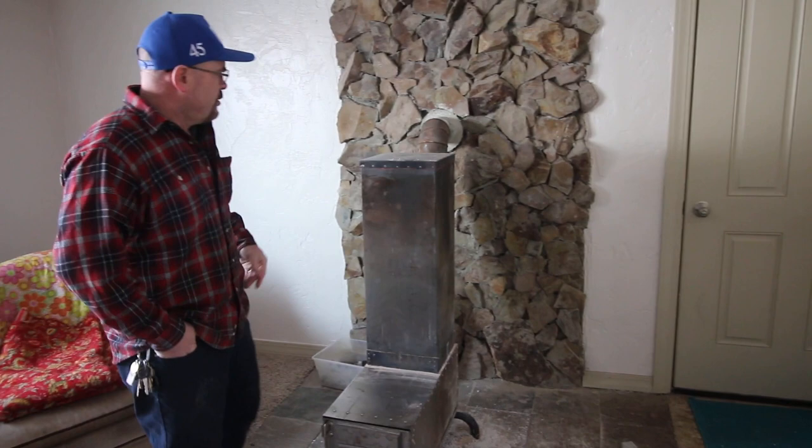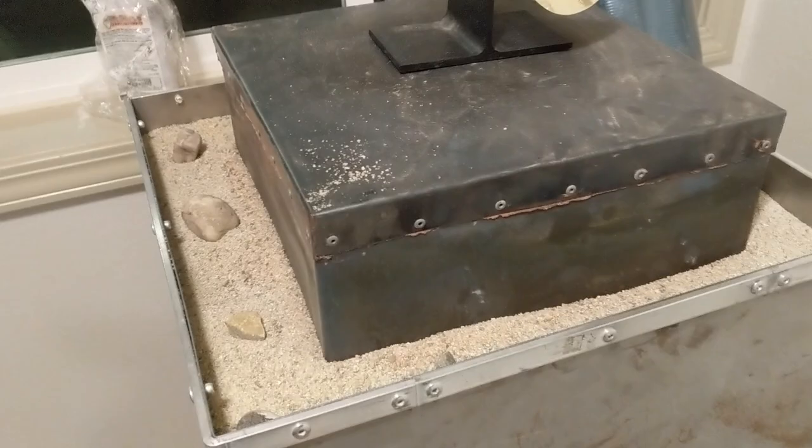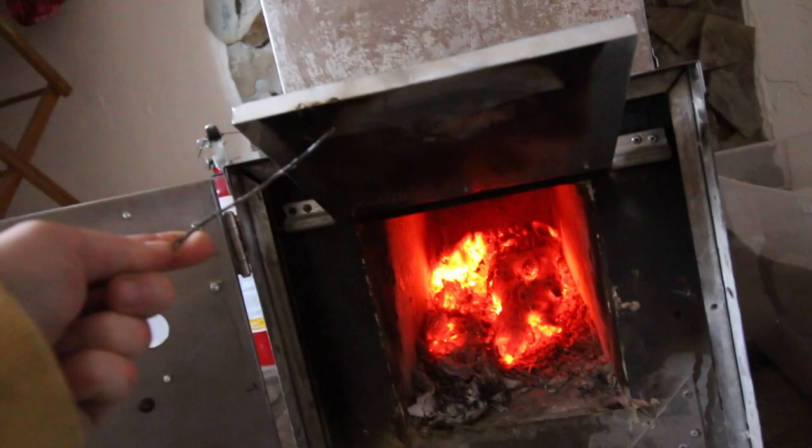Before Darwin takes this apart — you guys saw us try it with a shroud, and the shroud is meant to be a small mass, like a bench but very small. We found we didn't like the sand. The sand was easier because it would just pour out the bottom of the shroud, but it didn't work as well as a heat regulator. The reason is because of the density — if you think about it like ice: if you have a big chunk of ice, it takes a long time for the energy to dissipate and melt it. If you bust it up into a million little pieces, they melt away quickly because of the surface area.